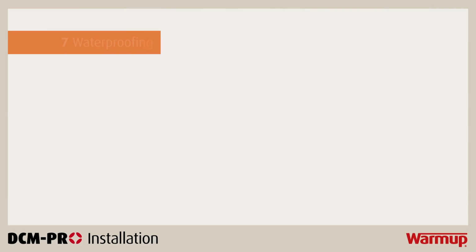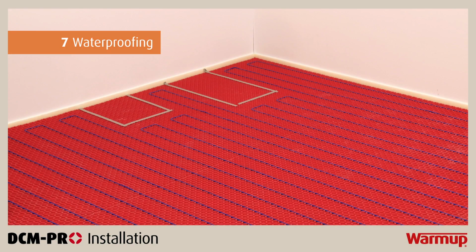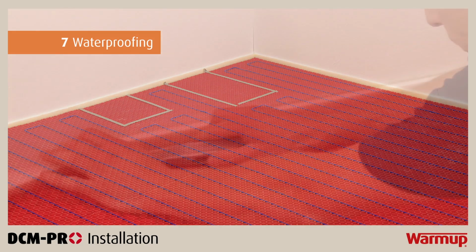There will be times when waterproofing will be required for your system, for instance in bathrooms due to the high level of exposure to water. Remember, if you are using a proprietary waterproofing system, a leveling compound must first be laid over the DCM-PRO system to provide a finished surface to install over.